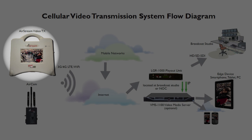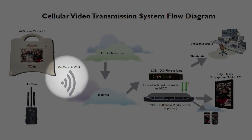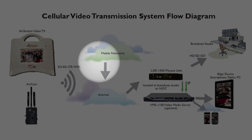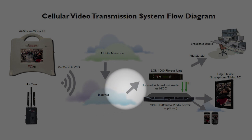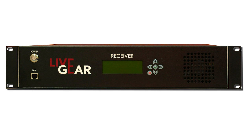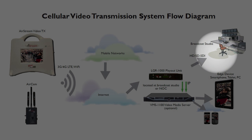As an overview, the Airstream encodes the HD or SD video into H.264 IP format and then splits the transport stream up for transmission via the available modems. All segmented streams are directed over the cellular broadband networks and the internet to an LGR1000 receiver located at your operations center. The LGR1000 aggregates by reassembling the four segmented streams into a single coherent IP video stream, which is decoded to an SDI signal that you can plug into your existing video processing infrastructure.